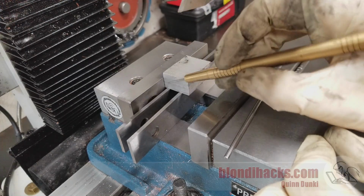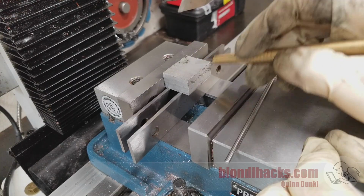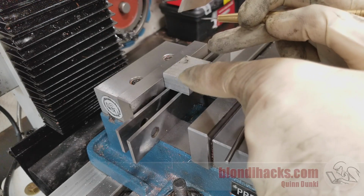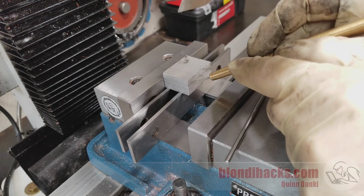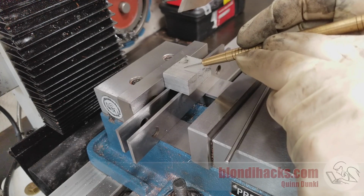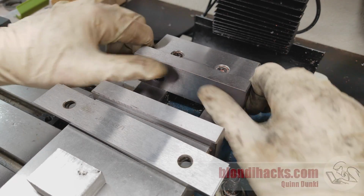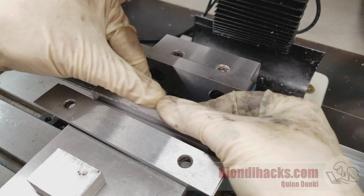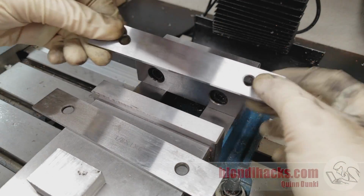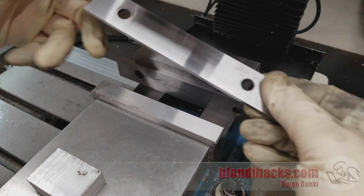And by starting with the flattest two surfaces that we have, we can ensure that we remove as little material here as possible. We're making sure that the stock is as straight as possible relative to the theoretical perfect rectangle that is hiding inside this rough shaped stock. Before you do anything, make sure that everything is clean. A chip in there anywhere will cause something to not be sitting flat or square or true, and that'll mess you up. So at every step of the way, you got to dismantle everything and keep it clean.